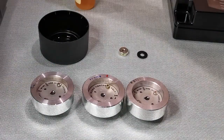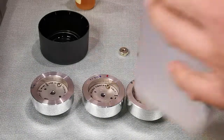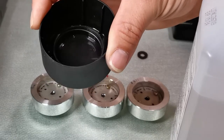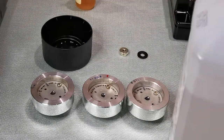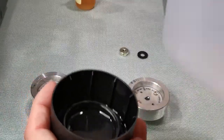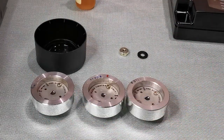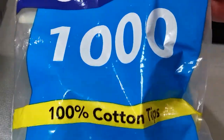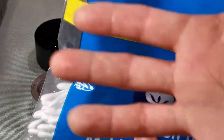I'm going to place the alcohol in a little container — just a plastic container that came with a tea bottle. What I'm going to use is cotton swabs — you can find these in any store. You can also use CR video drum cleaning strips — these are plastic strips with a material on the end made from goat's belly fur. It's a very good product for cleaning video drums, but I'm not going to use that today.